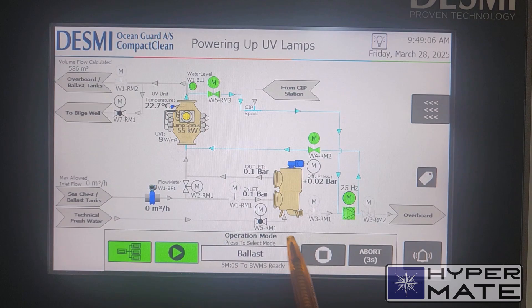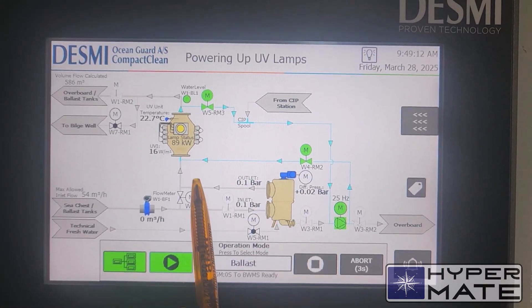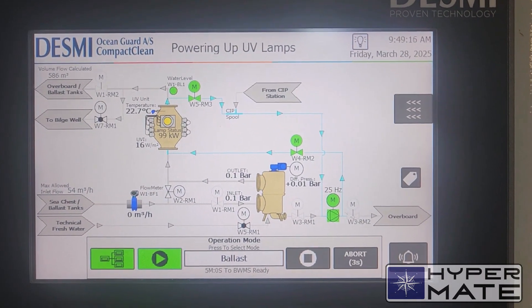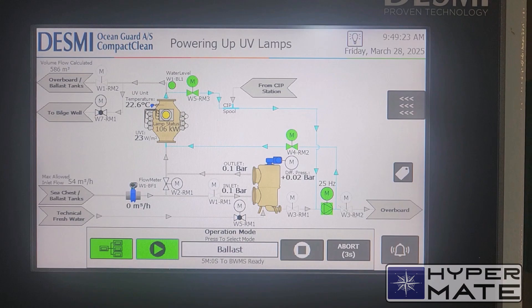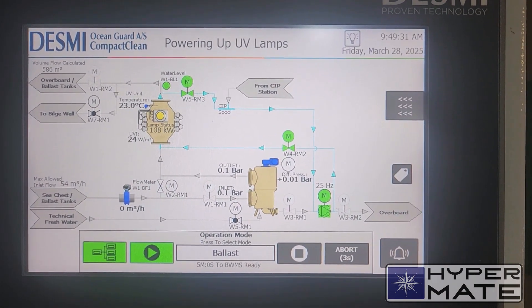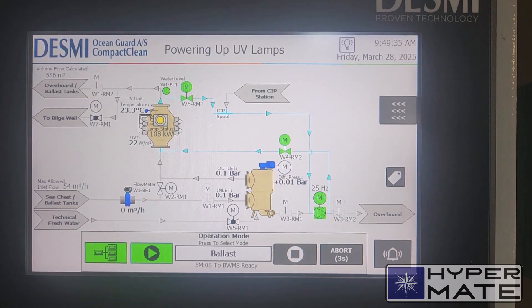Within uptake, I will remind you the water will go through the filter and through the UV reactor, and directed to the ballast tank. We are in the Mediterranean Sea now. Water is clean. We are underway. I will make a pause and continue when the UV reactor will be heated up and the pop-up message says 'start ballast pump rising'.